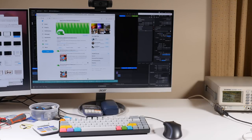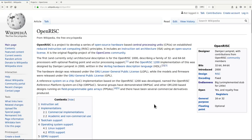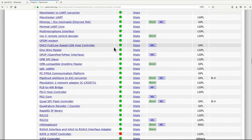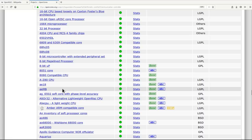After the last video another guy came forward and gave the project a massive boost. He came to me in my Twitter DMs and wanted to be known by the label MW. He said: 'Hi there, just in case someone else hasn't pointed it out to you already, I believe the ISA you have been reverse engineering is OpenRISC — the ALU on hex 38 is the dead giveaway I think.' And he was quite correct — this is indeed an OpenRISC 1000 processor, otherwise known as OR1K.